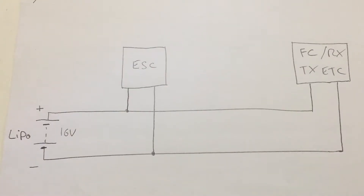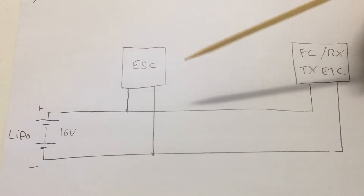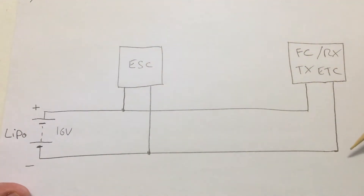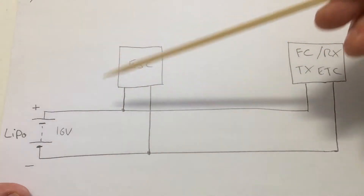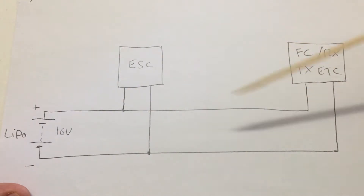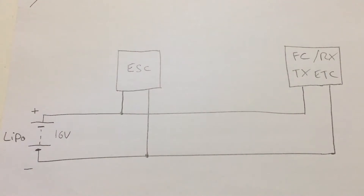In this next section I will be presenting my opinions on the use of capacitors versus the RC filter. In this first diagram we have a very simplified view of the electronic systems of our mini quads. We've got our battery supplying voltage to our ESCs and also to our other electronics like our flight controller, radio receiver, and video transmitter. You could think of this as a dirty section in terms of electronic noise and a clean section — a little bit of separation we're trying to achieve between those two areas. Let's take a look at a typical flight scenario.